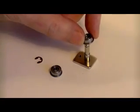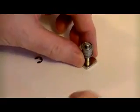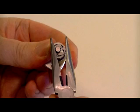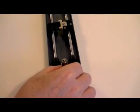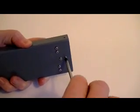Take the two bearings and note that each one has a wide belt retaining lip on one side. Slide one bearing onto the spindle of the bearing fixing base so that the belt retaining lip is at the bottom. Take the E-clip and grip it with a pair of long nose pliers. Push the E-clip across the top of the upper bearing and firmly around the spindle of the bearing fixing base so that both bearings are retained on the spindle. Align the two threaded holes in the bearing fixing base over the two holes in the Y-gantry bottom cover between the two shaft fixing bases, ensuring that the vertical shaft carrying the two bearings is positioned closest to the end of the Y-gantry bottom cover. Fix the bearing fixing base firmly with two bolts from beneath the bottom cover.